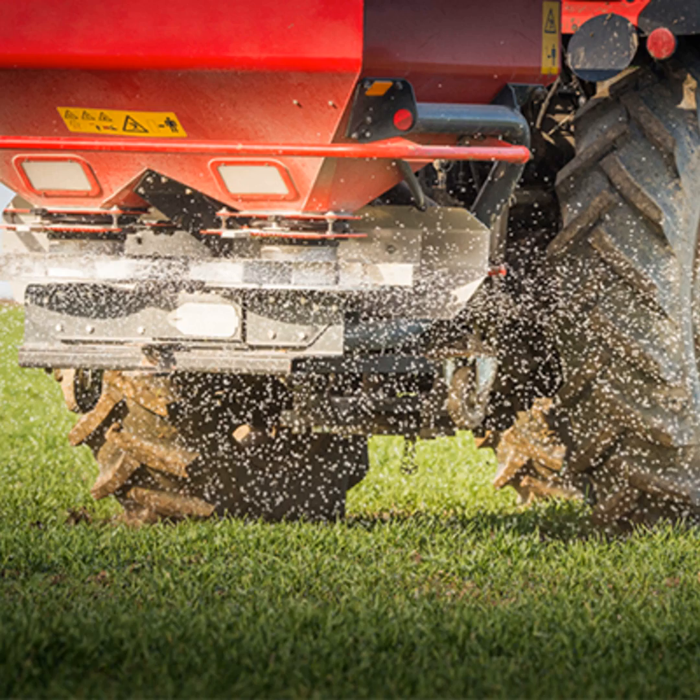We hear now from Francis. It's very important, at this time of year when you're taking it out for the first time, to make sure everything is right. The first thing you do is give it a once-over to make sure there's nothing damaged or broken on the frame. I'd also focus back on the tractor — check the top link and linkages to make sure they're all free. The last thing you want is to get a chance to go spread and realize the top link has seized or there's a crack in the frame.